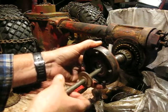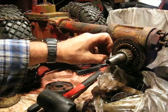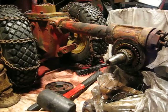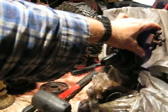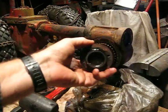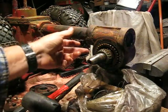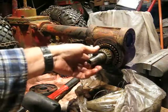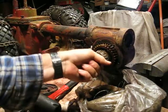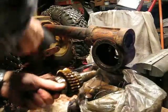One of the things that wasn't so easy was taking it out of the other side. You also have to watch out when you take it out — there is a key in there. This is the bronze gear that turns the back tines, and I tried everything to get it out; she wasn't moving. Eventually I had to take the rear mount off the back here. This is where the shaft is, and there's a set of bearings and a race in there. You have to back it out a little bit to relieve the tension, then I used a rubber mallet again and just kept tapping it. She'll eventually work out on her own.